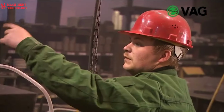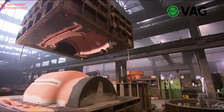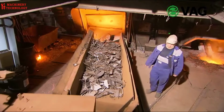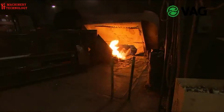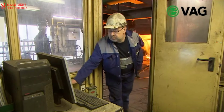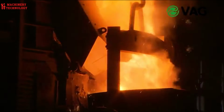The foundation of this durable valve is its body, typically crafted from high-quality ductile iron. This iron boasts exceptional resistance to both corrosion and wear and tear. The casting process itself is an intricate dance. Years of experience and an intuitive understanding of the iron alloy are crucial. The pouring temperature must be precise, as is the entire process. Improper cooling can ruin the entire valve body.